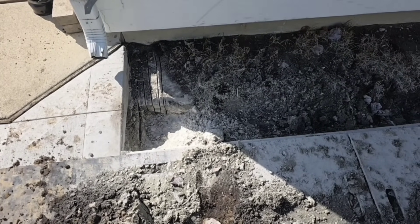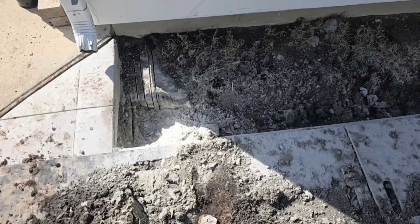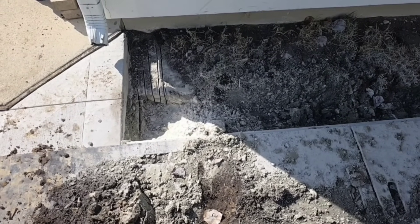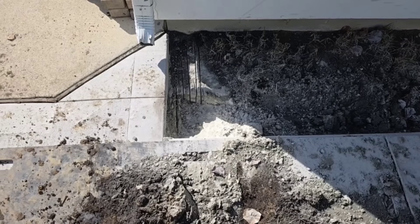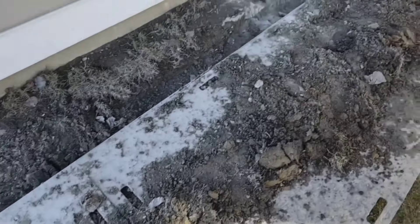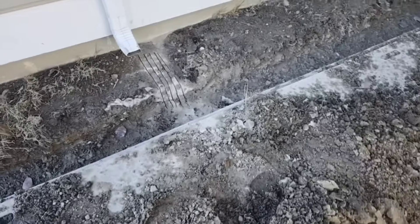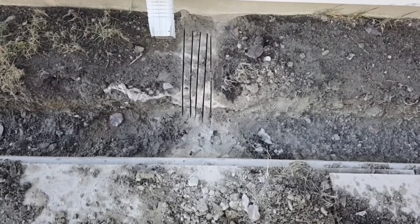The footing was poured way out — we only have this much room to run a pipe in, so we can get a main line through here, and that's it. The guys went ahead and cut that footing. You make several cuts like that with a cement saw and it'll break out real nice.